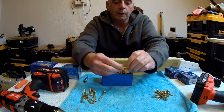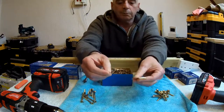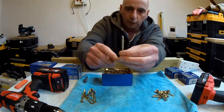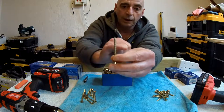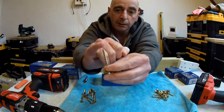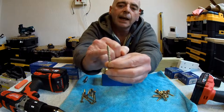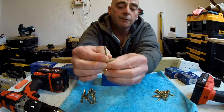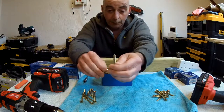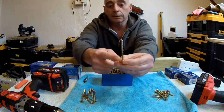So why are these so special? Some screws have a little cutout on them to help them start better when cutting into wood, clearing a bit of wood away. These haven't got that. What makes these work is the thread: they've got a sharp little point, the thread starts off very fine and quickly increases in size and depth as you go down. This gives a very good pullout rate, meaning in masonry with a 6mm wall plug, you get one hell of a grip.